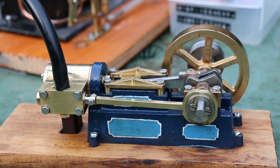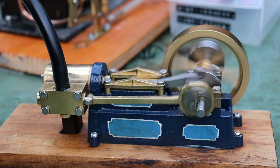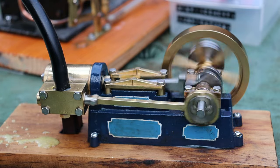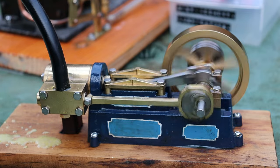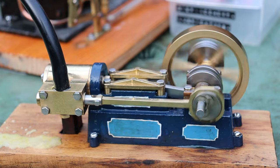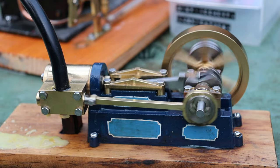Okay so we're up to pressure, so we're going to give the engine a go. Straight away, take it easy because I don't know what it's condensing in the cylinder. Only give it a tiny bit of steam whilst it's still warming up.